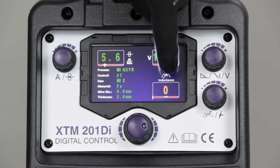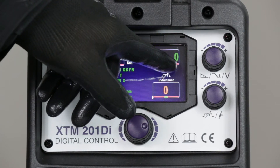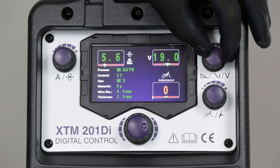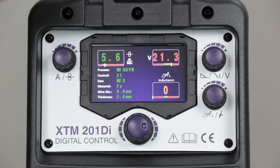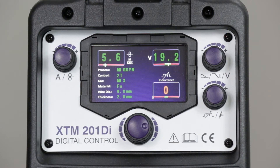Across the top we've got two digital readouts — one displaying wire speed, the other welding voltage — and at the bottom an inductance setting. You'll notice at the bottom of these displays there's a small green sector. The machine has preset the wire speed and voltage within those green sectors at a value that will give you a good weld from the start. If you want to trim those — for example if you're welding out of position — you can use the knobs at the side to adjust within that green range. If you go outside the green range, the display goes red, meaning the machine will still work but it's unlikely you'll get a good weld because you've gone outside the stable parameters for that wire size and material thickness. Keep it in the green zone.